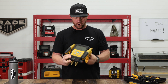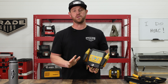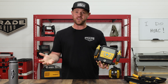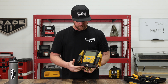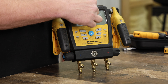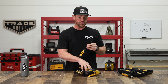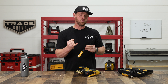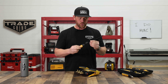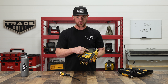Going back to the manifold — this is really nice. Spoiler alert: I think it's awesome to have both tools; they both have their place. One can outshine the other depending on the application, and at the end of the day it's personal preference. What I really like about the manifold is that you can have everything sent to this display. You can connect the indoor sensors for return temp and supply temperature, so if you're reading delta T or temperature rise, it'll give you the readout on screen — and I can show you that in a bit.